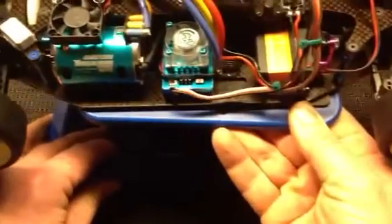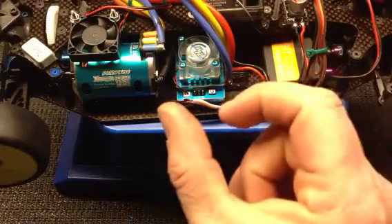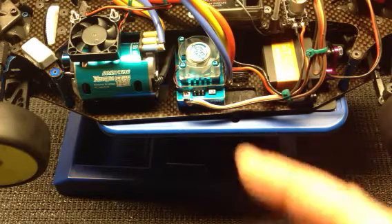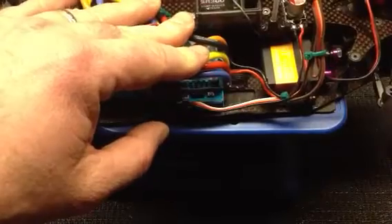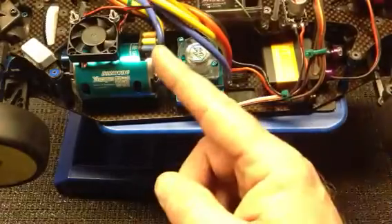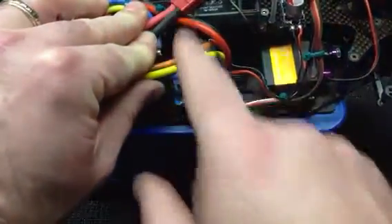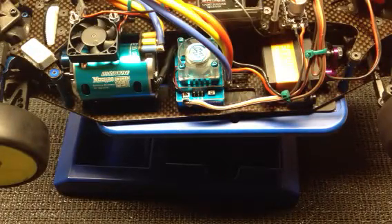This thing is excellent. It's only 37.5mm long and 31mm wide — super easy to install because it doesn't take up any space at all. Really tiny but really powerful. The wires are already attached to the speed controller for your motor and your batteries, and the capacitors are already wired in — that's done for you. It doesn't come with any wire ends for your motors or battery; you'll have to install those. I installed a Deans connector, but you can put on anything you want based on your personal preference.